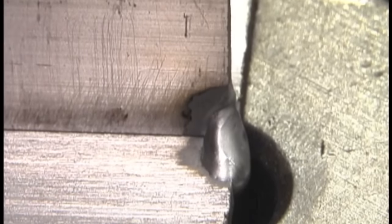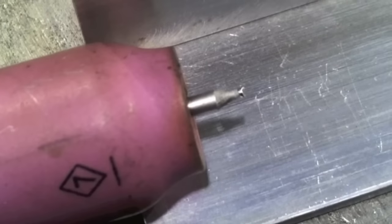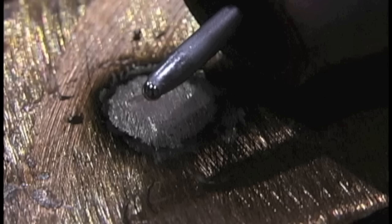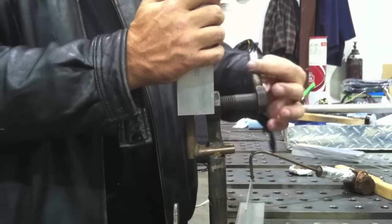I'm going to put a tack on the end here. I've got a tapered electrode — 2% lanthanated is what I'm using today. Inverters a lot of times put little nodules on the tip of electrodes. When I've got those nodules I just round it off by turning the AC balance down really low, where there's a lot of reverse polarity in the alternating current, and put a little rounded tip — not a big ball, just a rounded tip. So I've got a tapered tip with a rounded ball that'll be stable through the whole joint, light up at low amperages, and won't change on me while I get up to max amperage.